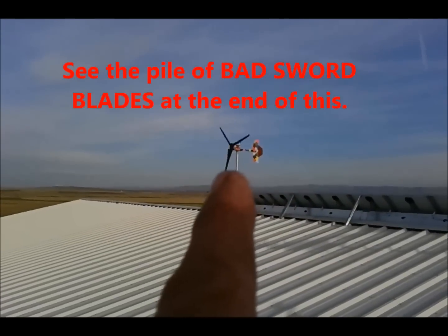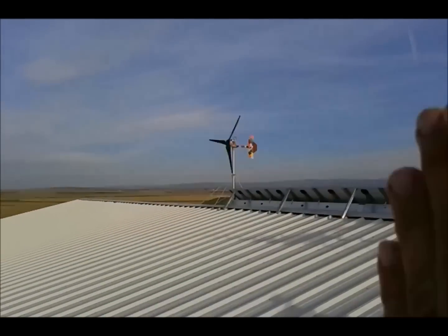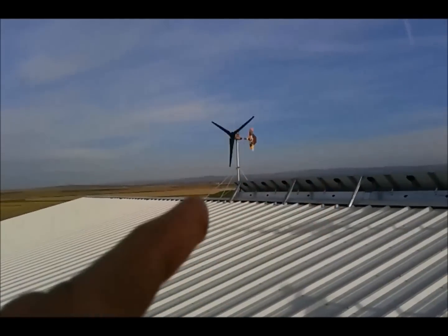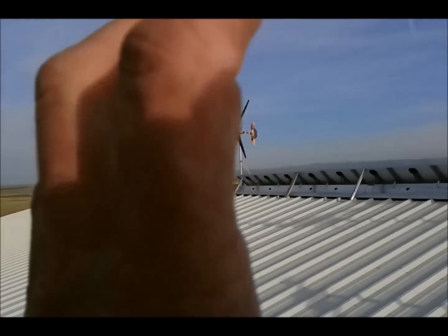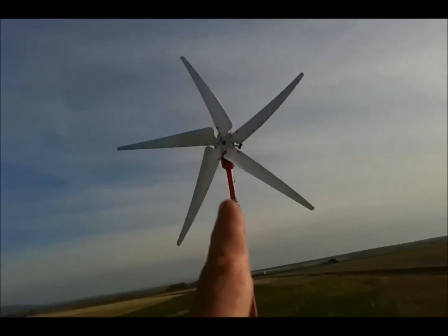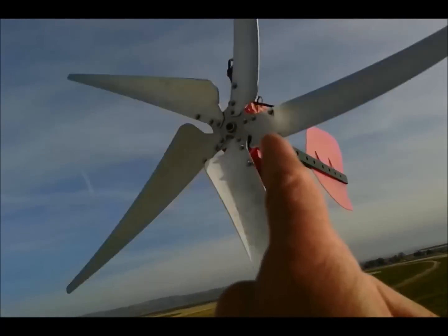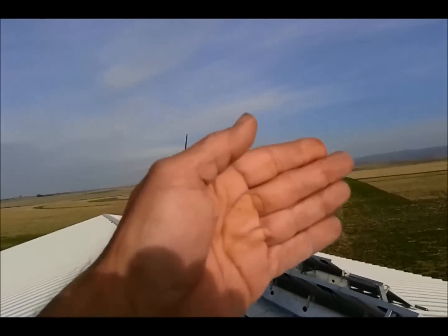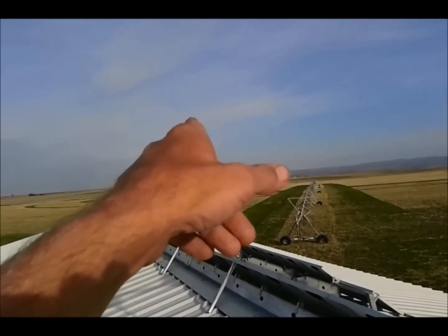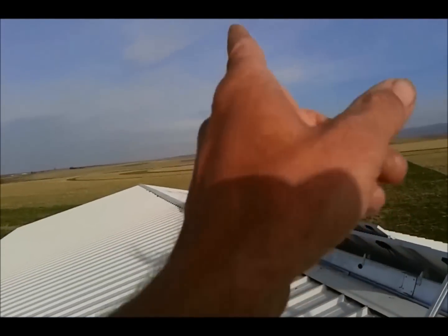Everything dimensionally is 30% bigger and the airfoil effect on the back of them is a huge increase. It actually dumps the wind out of them instead of wind-walling. These dump out their wind, allowing more wind to go through them, instead of getting so many blades that it becomes one solid wind wall. These can become a wind wall at about 40 miles per hour, which is good, but my furling system goes into effect when they wind-wall. That thing has an angular side mount, so there's torque — I noticed at about a 30-mile-per-hour gust it wanted to do a little of its own over-torquing, and that was perfect. I hope he makes more of these blades.